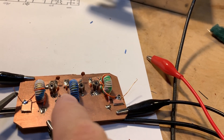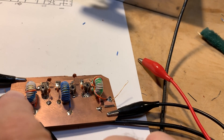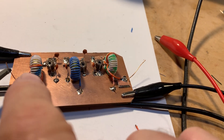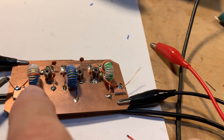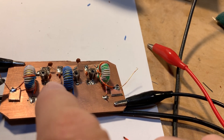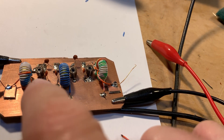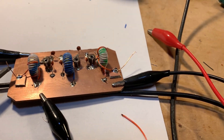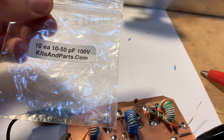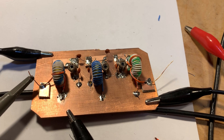There are the three toroids. I used insulated copper wire in three different colors — it's a colorful thing. They're all yellow-core T50-6 toroids. There are three 68 picofarad fixed caps and three Kits and Parts 10-to-50 picofarad trimmers. It all went together in about an hour.